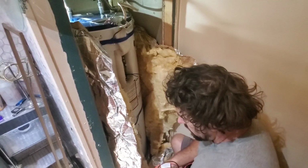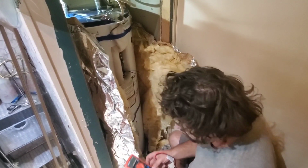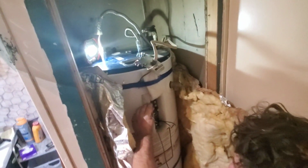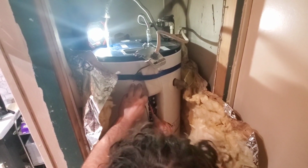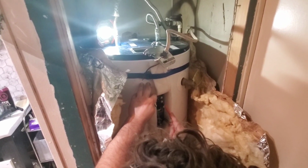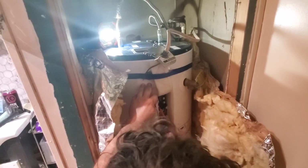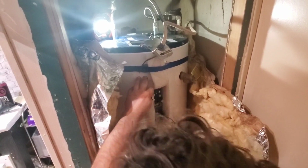First, we have our power all unhooked still, and we're going to turn our voltage meter to our lowest ohm setting. We're going to touch our 120 power right here, and as you can see, it moves, and we went close to 0. That's our top element. We move over here, and you can see our bottom element has nothing. But then we move to this terminal that currently is supplying power to our top element, and you can see it moves and it wants to be 0.